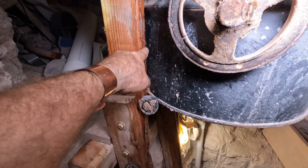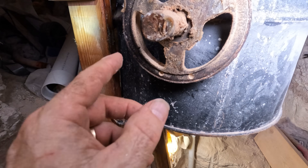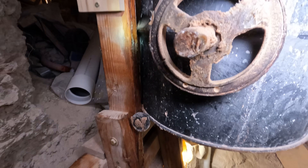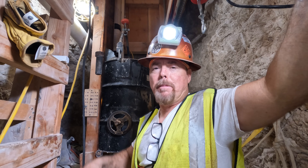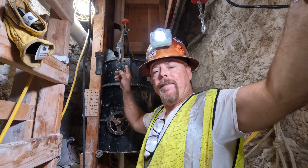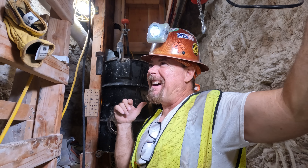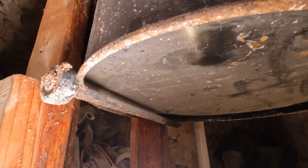The bale normally wants to go forward — you see how the butt of the drum is actually being forced into the rail and there's an actual gap right there between the rail and the drum. Offsetting the center of gravity means all your additional weight forces the drum to the rear. The area rubbing on the rail keeps the bucket from rotating left or right, which keeps the trunnions from hitting any additional timber on the way up. The rails also keep the barrel from rotating, and you can weld a hook on the bottom if you want to lower stuff down into the shaft.